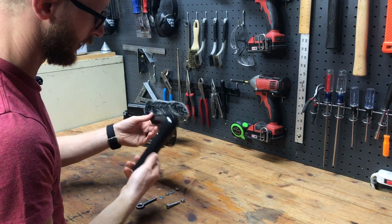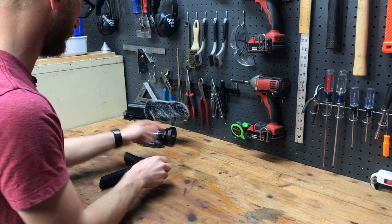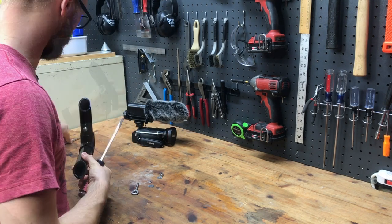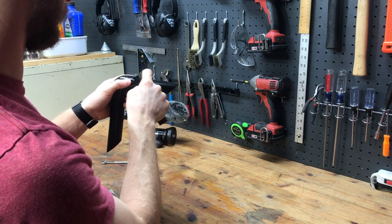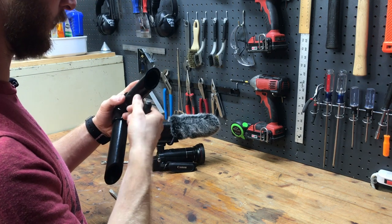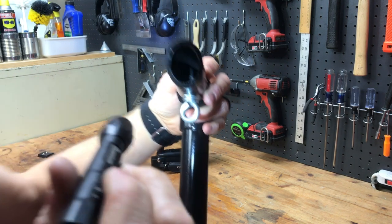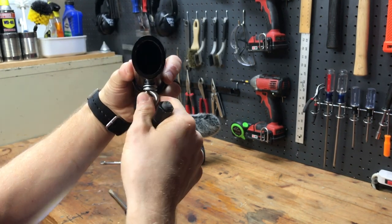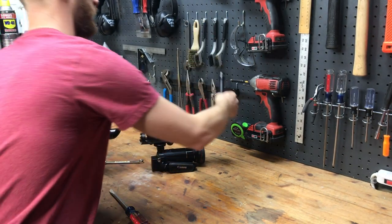We're back — everything's all painted up. I went ahead and put on a few coats of black with some clear coat for protection and longevity. Now we've got a quarter-20 bolt with threads filed off so it fits well and easily into the keeper hole, and then the quarter-20 eye bolt with a flat washer, split washer, flat washer, and nylon lock nuts inside. The nylon lock nut on the pin bolt is all the way down to keep it tight, and the nylon lock nut on the eye screw is set so it can't back all the way out and fall out of the hole.